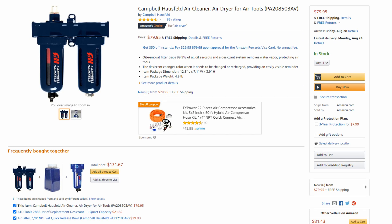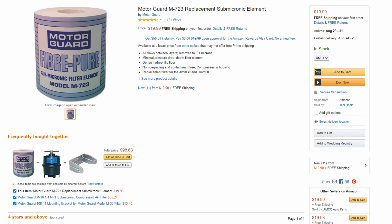Now there is another style of filter — a two-stage filter. This has a particulate filter on one side with a drain that catches oil, and on the other side it has a canister that holds desiccant beads. The beads absorb moisture as the air goes through and will change color when they're ready to be changed. These do work well, but my biggest gripe is that the beads can sometimes spill when you're changing the filter. It's just not as easy as the standard Motor Guard cartridge style filter, which is why a lot of people prefer those — it's easier, cheaper, and just a better experience overall.